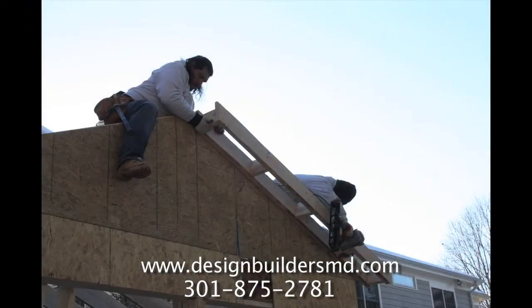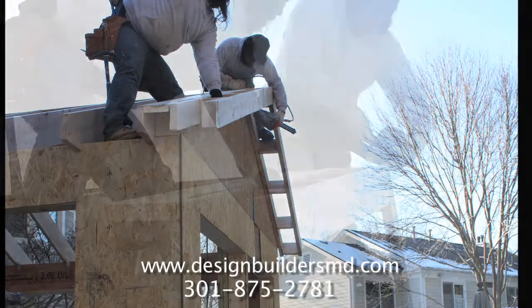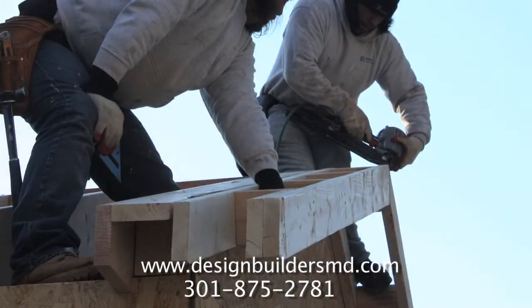The rake is an overhang that is installed on the front of the gable. You want to match the overhang created by rafter tails, but on the front of the gable, since there is no overhang, a small wall, typically 8 to 12 inches, must be framed and installed on the front of the gable. The plywood sheathing covers the rake and the rafters, making a seamless roof.